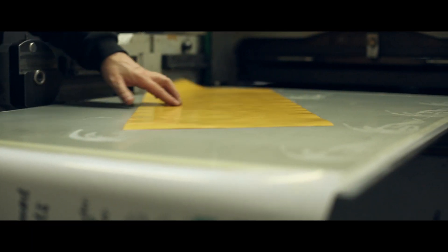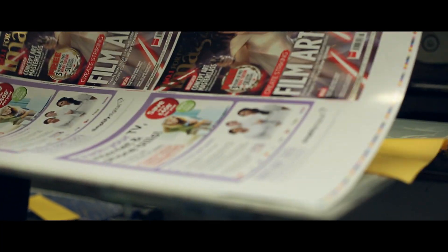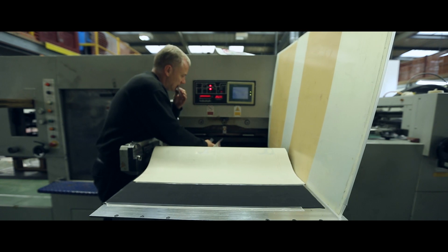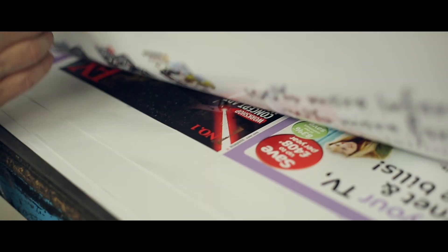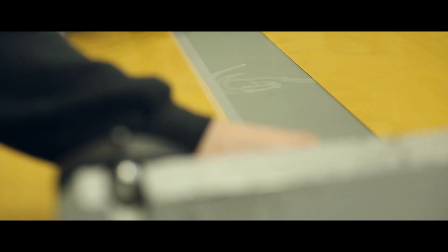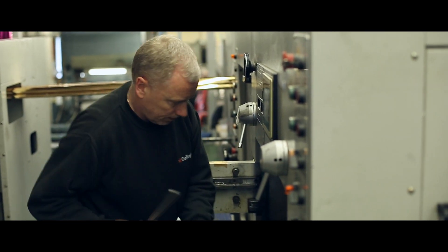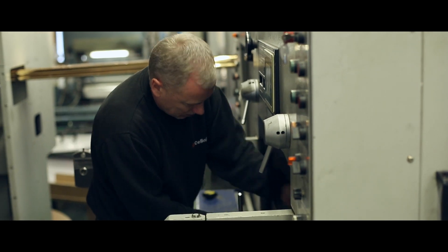The real art comes in the make ready — this is what they call the black art of foil makers. How they achieve the flatness of the foil from a standing start. You can see some of the sheets here aren't quite up to the mark; the foil isn't flat and you can see through to the print. But after he's packed it with very, very fine amounts of paper, he will get it to the right level and it will be perfectly flat, all in position and ready to run.